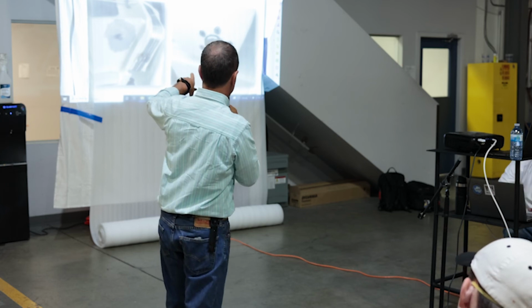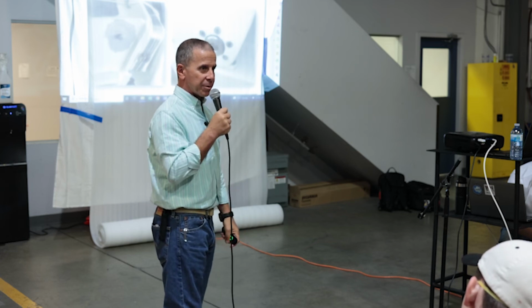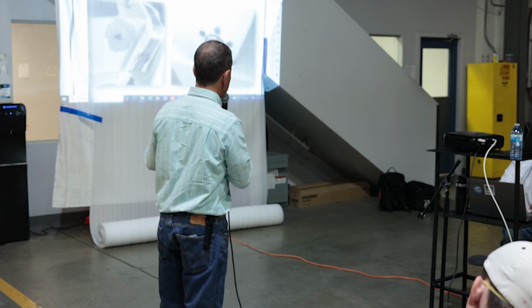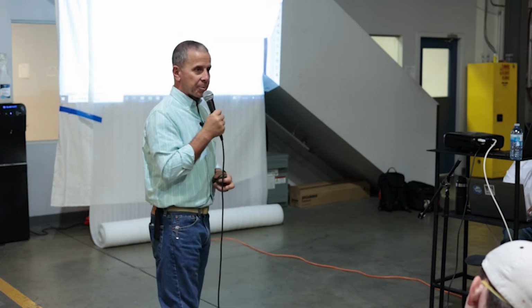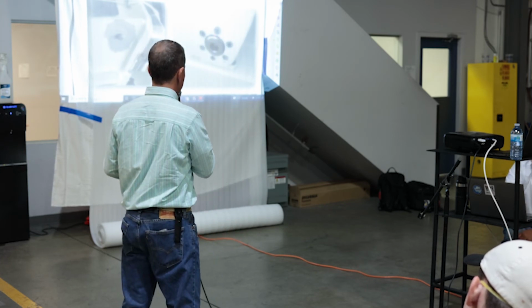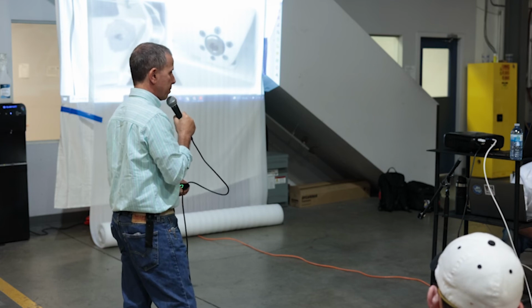So in these examples, that one on the left, clearly that fastener wasn't bedded. It cut into that paint the day it was installed, and that process started that moment and just got worse. With all those fasteners around that, I don't know how well you can see this, but that paint is all blistered, and it's because of those fasteners. There's no doubt in my mind. There's also a sharp edge right here. Yeah, and a sharp edge right there, right? Yeah. Is that powder coated or painted?